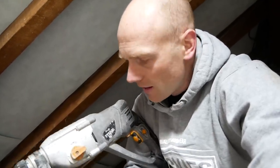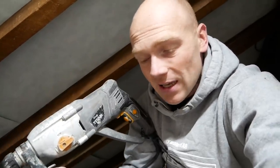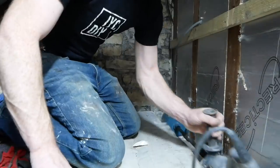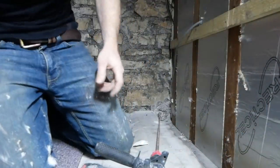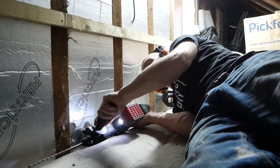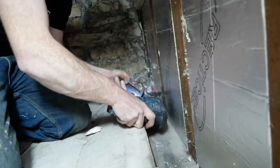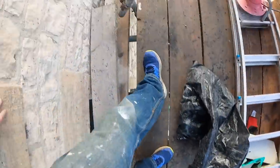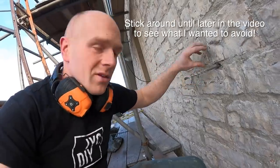That should be just fine. The poor old heroic Titan gave up a few weeks back — it's perfectly fine on drill mode but it's just got no hammer function anymore. But the nice thing is we don't actually need a hammer function for the core, so I can still use this to do the fair share of the work. Chances of keeping this straight on the way out are slim to none. Just going to see where that came through — hopefully not through somewhere where we don't want it. That's about right. Hopefully what that means is we can also come in for the last little bit from the core from this side, which just makes sure we don't have any blowout on the stones.